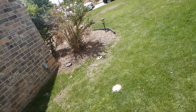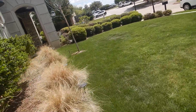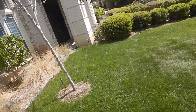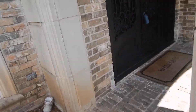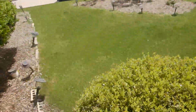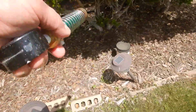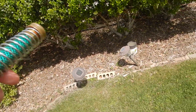The only way I know to turn off the water is at the meter over there. We've confirmed 100 PSI. I can't get into this faucet, so let's move to drainage. Hopefully I'll find a main water shutoff valve while talking about drainage — it happens sometimes. We've got a double clean-out — that's a sewer clean-out — located on the east side of the front portico.